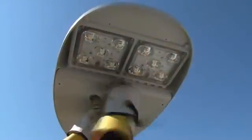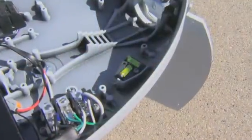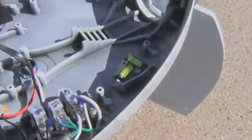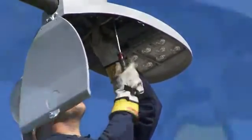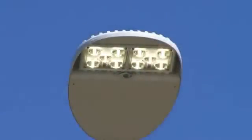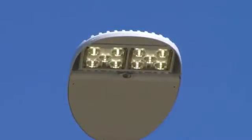Access to the wiring compartment is easy, with tool-less access standard on every XSP Series LED street light. A two-axis level helps the installer ensure the luminaire is mounted parallel to the ground for optimal application performance. Power is connected to terminal blocks to minimize clutter inside the luminaire. There's even a terminal block for 0- to 10-volt control wires included in every luminaire for dimming control by others.